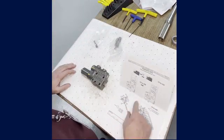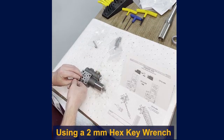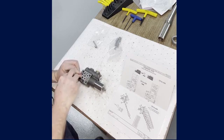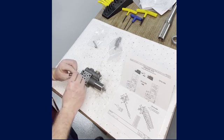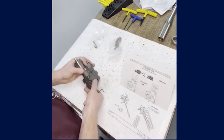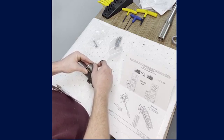Off to the left we're going to look at all the different items we need to remove. The first thing we need to remove is a plug on the back side of the compensator using a 2mm Allen. We're going to get in there and remove this plug. The vent port would be connected here for your remote pressure control.